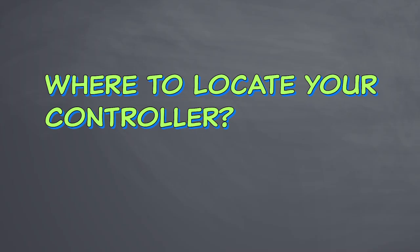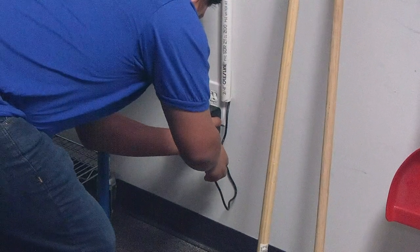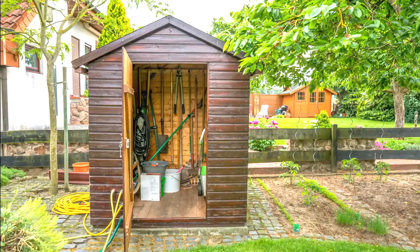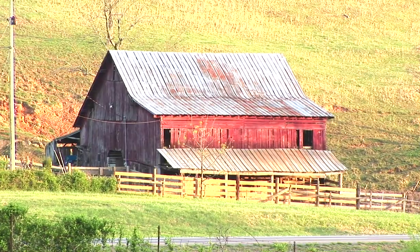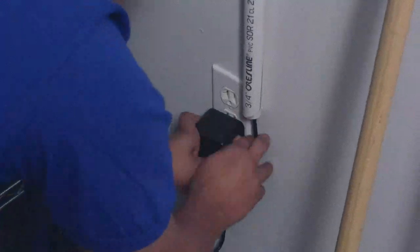Next, let's look at where you are going to locate your controller. Sprinkler timers come in indoor or outdoor models. Indoor models are not weather resistant and come with an attached external transformer that plugs directly into the wall outlet. You never want to locate an indoor controller outside. Typically, indoor units are hung on the wall in a garage, closet, shed, pump house, or some other structure like a barn, but always near a power outlet so you can plug in the attached power cord. The critical thing to remember when choosing the location for installing an indoor model is that you always have to protect it from the effects of Mother Nature.